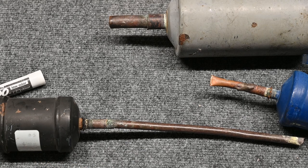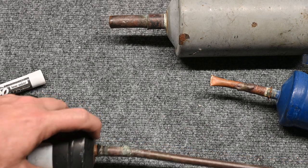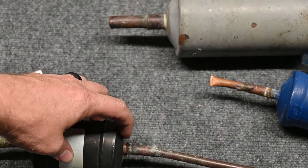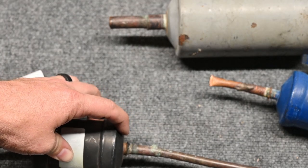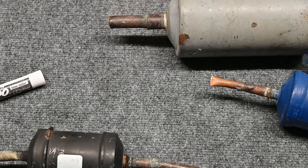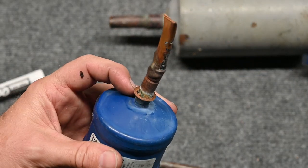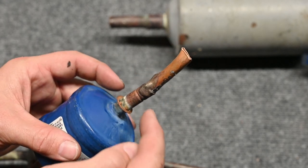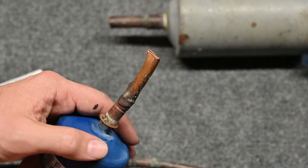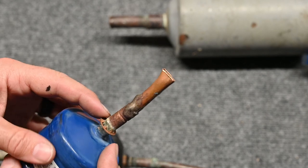A lot of information goes into these. When brazing, if you have this line outside, you want to make sure you protect the filter dryer. The flame can end up burning the paint off, and when you burn the paint off it'll end up being a spot that rusts out, especially in places like Florida. Some of these manufacturers actually put a really cool little metal ring on here — this little metal ring helps divert the flame. You still want to protect it with some kind of rag or heat-absorbing paste, but it's a nice little advantage.